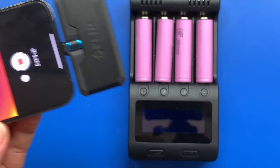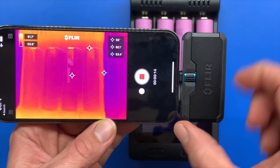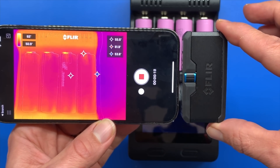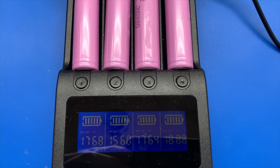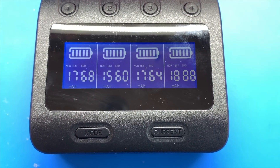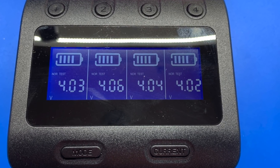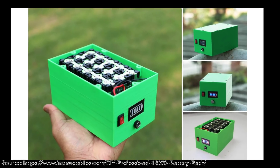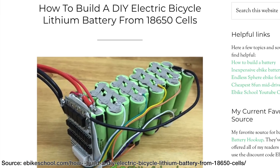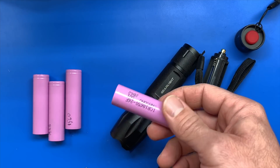Because this was my first time and I was a little concerned, I kept an eye on the cells with my thermal imaging camera while they charged to look for any excessive heat buildup — thankfully there wasn't any and they seemed to be charging normally. After the tests completed I was excited to see that all four batteries had very healthy capacities around 1700 milliamp hours and all held over four volts of charge. People find all kinds of uses for these 18650s — making new battery banks, new batteries for e-bikes, or other projects.